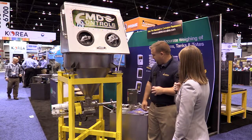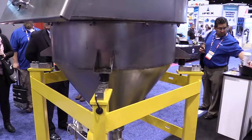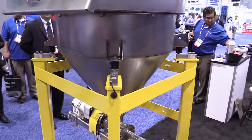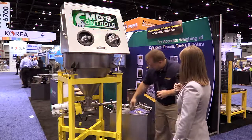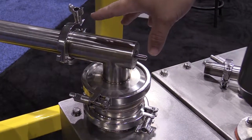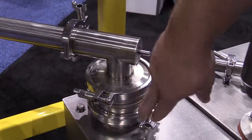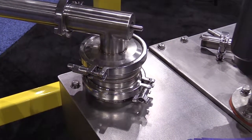The key feature is we have quick clamps throughout the whole unit, so you don't have to use any tools to take apart the unit — it's all quick clamps, just twisting them open. Our unit is completely sealed from the point where you put the bag inside until it comes out into the mixing tank. A lot of people just dump out of the discharge spout into the mixing tank, but ours has a flexible seal so even throughout the auger, no dust can come out.